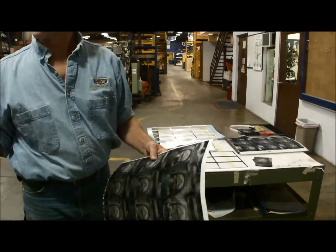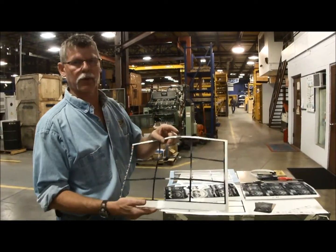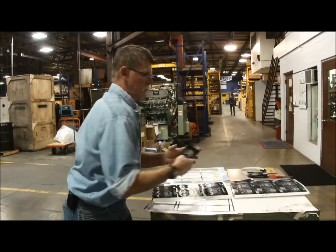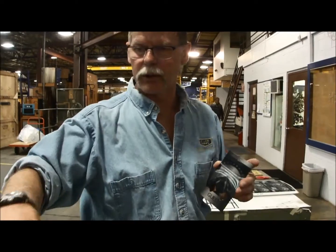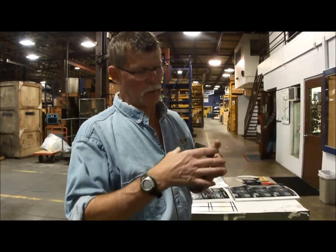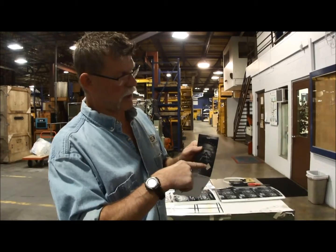Once I let it warm up to 120 degrees — we're at 100 degrees now — the very first sheet cut through. Now, it's possible this die is clean cut around the outside border; there are no ties in it. So it's possible when the delivery drags they might fall off. It depends on your customer if they want clean cuts or if they can put up with a little nick to hold the sheet together to hand strip it later. These little diamonds in the center do have ties — they won't fall off; there's a little tie on each side.